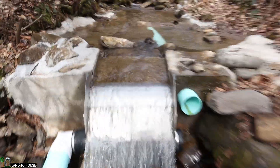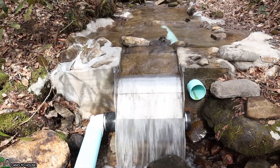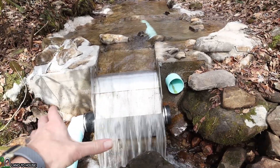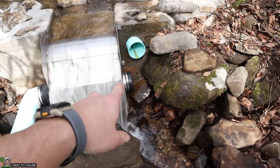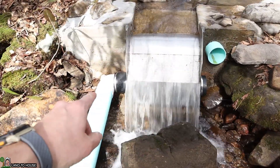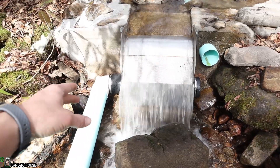This box is made of stainless steel and it has six-inch outlets on both sides of the box that allow you to use a FernCo fitting to connect to a pipe. This allows the water to flow from the lower section of the box down and out the penstock.